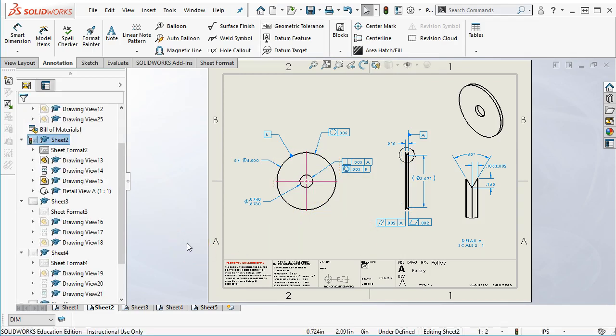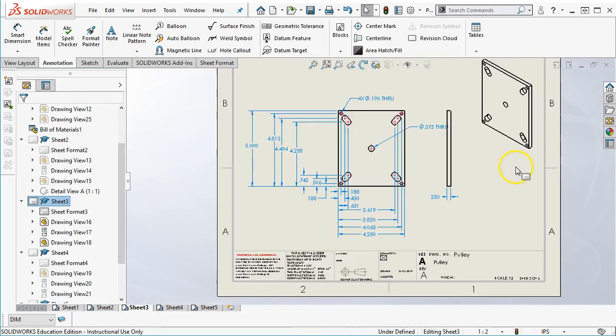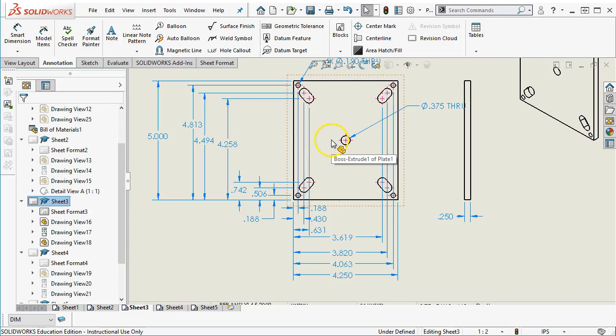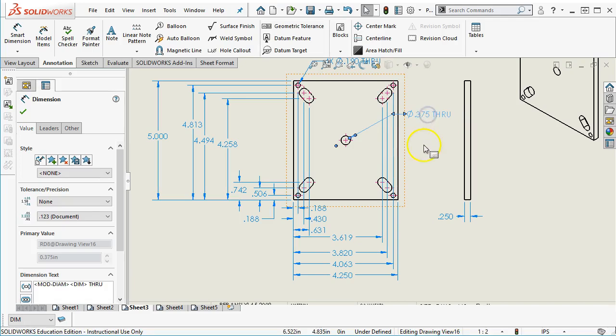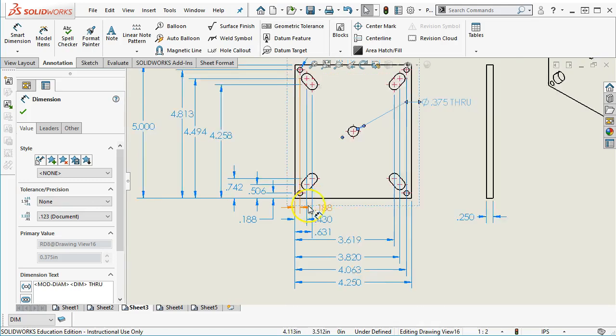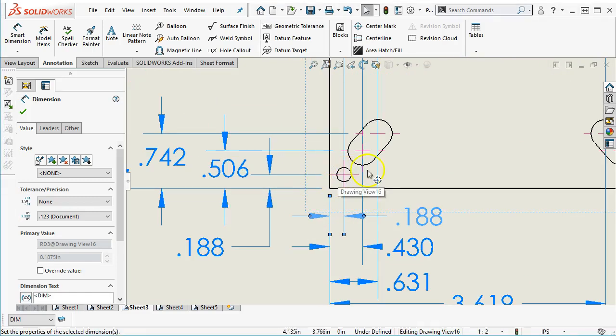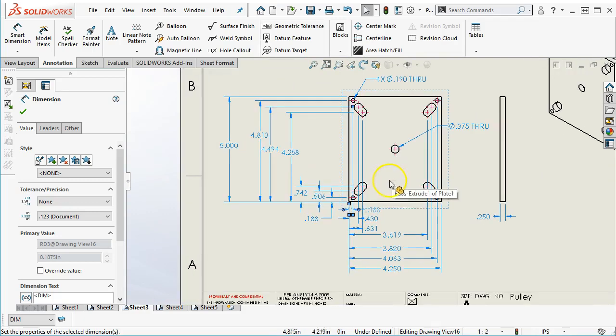All right, so complete, not quite complete. We're at that next stage of a jumping off point, and coming over to sheet 3, then we have all of the tolerances of all of these geometries. Then there isn't anything in here really that can use the positional tolerance. It would be nice, but when we think of these being at 3/16 with the basic square tolerance, this is something that's going to have to be analyzed further.